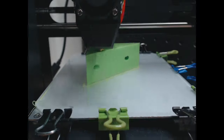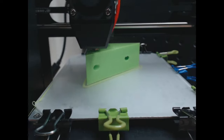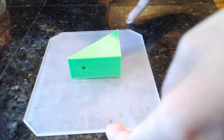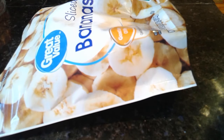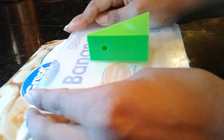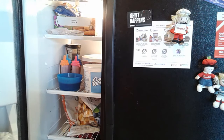I'm printing on my new glass bed, which I'll talk about in a later video, and I'm quite happy with it — it works really well. There are a lot of clamps on it like little paper clip holders, but all in all it works great. Now you can see I struggled with trying to get the print off the bed because I had about three layers of glue on it. Something I saw you could do was take a frozen bag of fruits or vegetables out of the freezer and put your print on top. I did this because I wanted to take it off easy, but it wasn't working. The first two times I did this with previous prints it did work, so I decided to pop it in the freezer for about five to ten minutes.